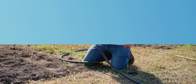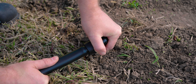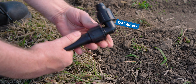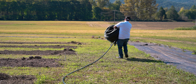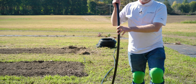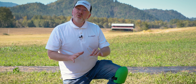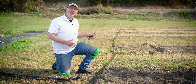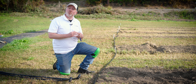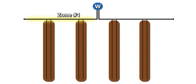I'm going to run the mainline tubing for each zone from the head assembly down to the base of our field. There, I'm going to cut into it so I can install a 90-degree elbow to turn our mainline tubing perpendicular to our field. Run your mainline tubing to the last row, then unwind the other end up to the elbow fitting at your water source. The kit comes with staples to hold your mainline in place. Since this is a two-zone system, we're going to make a cut into the mainline, connect zone one going down this way, and connect zone two to go this way.